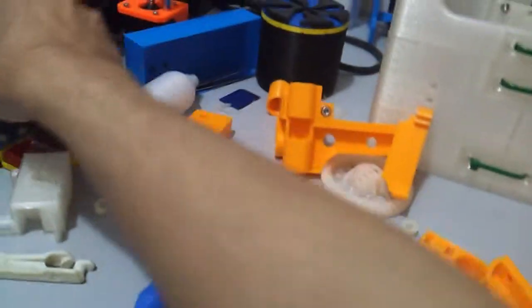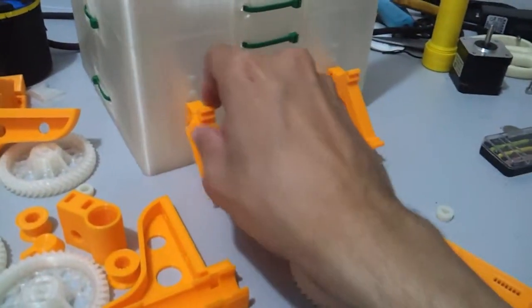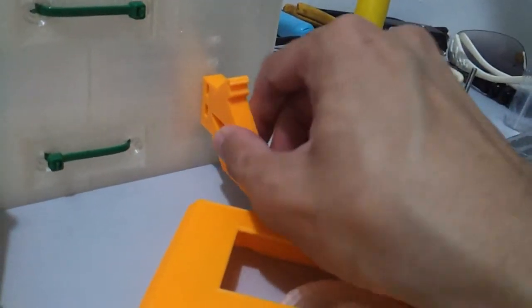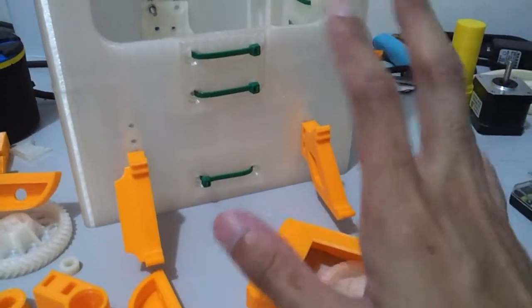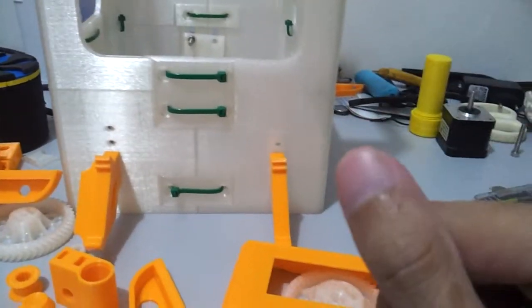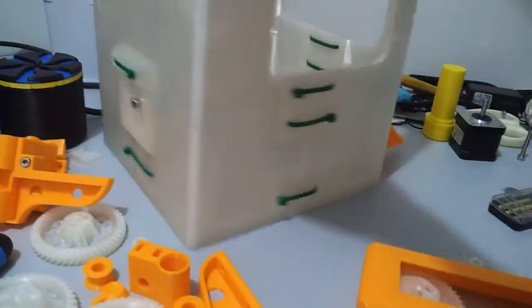And yeah, 100% of these parts are printed from the Prusa i3 Mark III, and I made a few adjustments to the original files, especially this one, the bottom parts, two of the front bottom parts here. I added about four screws here for me to mount the LCD panel, because back in 2012, there was not much of an LCD panel implemented yet for most 3D printers. Although there was, that is for a smaller type LCD panel, which doesn't have any SD card feature anyway. But that one is actually for the acrylic, laser cut version.